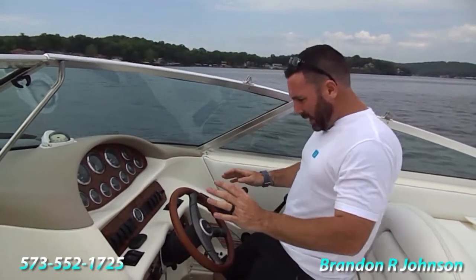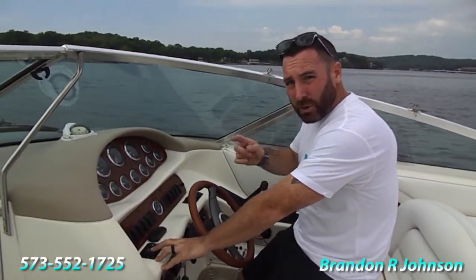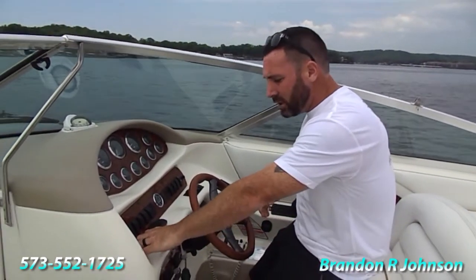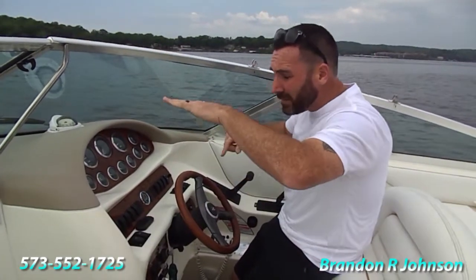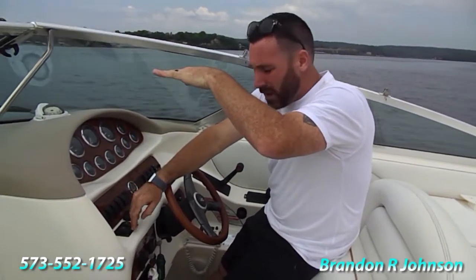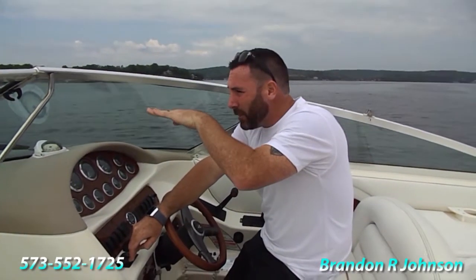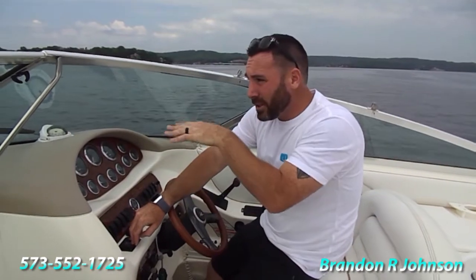So that being said, one more time, trim tabs, the flappers on the side of the boat, they're made for lateral stability or to correct lateral instability. So if you have heavy friends on one side, just double click it like a computer mouse. So if heavy friends are on this side, naturally a boat's going to lean their way. So double click this side of the boat, one, two, and level it out. Only touch these if you're going straight. You may even pick something in front of you to use as a reference. If you're turning when you're touching these, it's going to mess you all up.